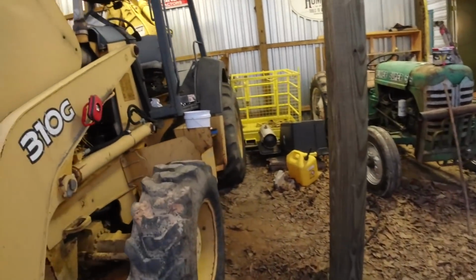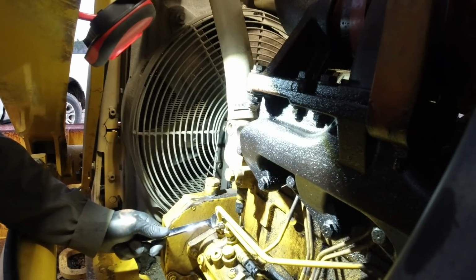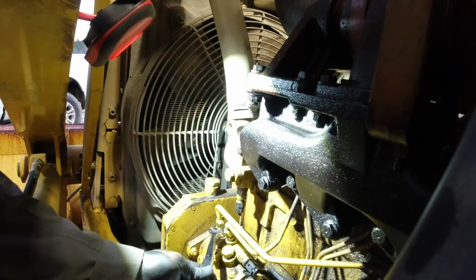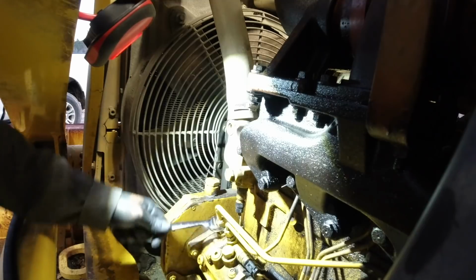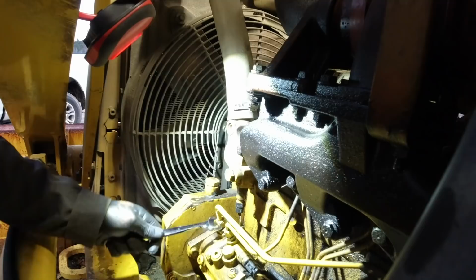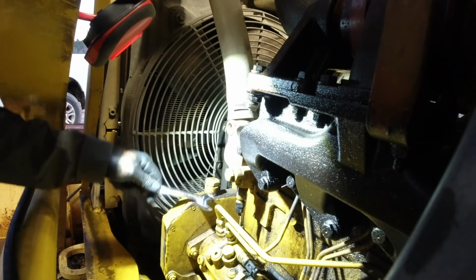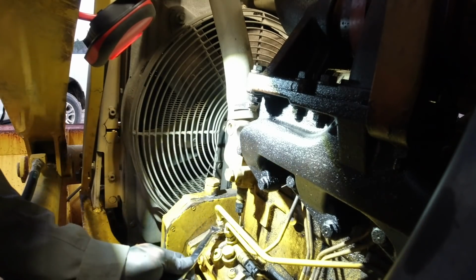Okay. Let's go see. We're going to start cracking them open. All right, we're going to start with this one. Go ahead. Nothing yet. Is that thing running? Yeah, running. Oh, there it is. I can hear the air in it. Supposed to be able to crack that thing back a little quicker, I would think. See the air in it? Getting the bubbles out of it. But I'm tightening it. Keep going. I got it. There you go. Steady flow.